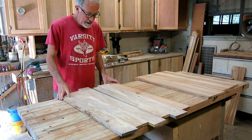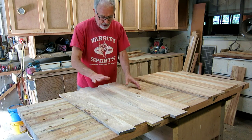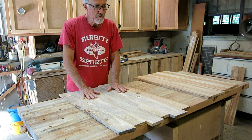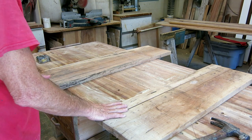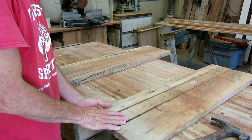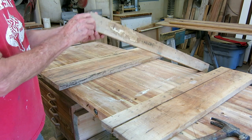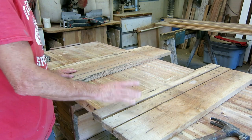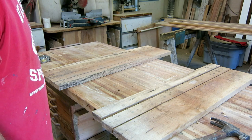These are the four panels I glued up yesterday. Today I ran them through the thickness planer to get them all the same and thin them down a bit, and I jointed the edges. I'm going to glue these two panels together - that's going to be the two ends of the chest of drawers, and I'll set these in a frame just like I did the plywood on the back. I pulled the next plank, cut it way longer than I need for the front stiles, and ripped them two-and-a-half inches wide - four of them out of this plank, two out of this plank. I need to joint these because they're twisted, then run them through the thickness planer until they're all the same.